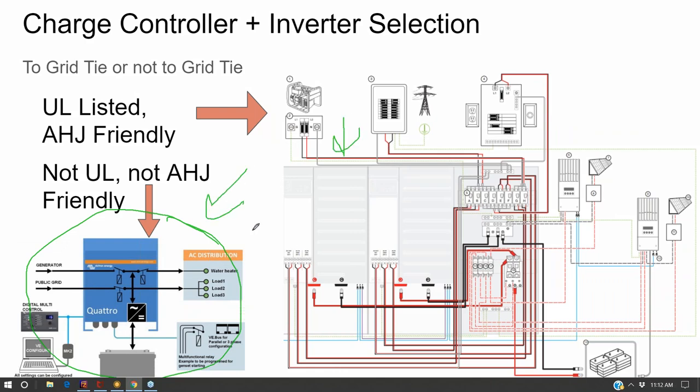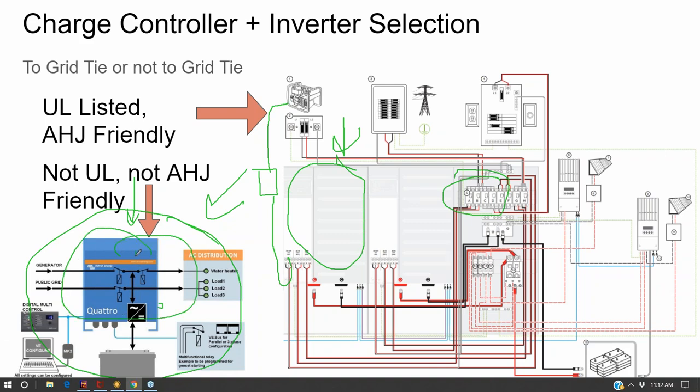A nice thing about these all-in-one inverters is, say, with the Schneider system, you have to buy an extra component and wire it up that'll start the generator, whereas with Ames, the auto generator start is already built into it. Here is a transfer switch that is external to the Schneider system. Again, because it's designed to be stackable, there's a lot of external parts that you then add on to it. Whereas with an all-in-one unit, that transfer switch is already built into it.